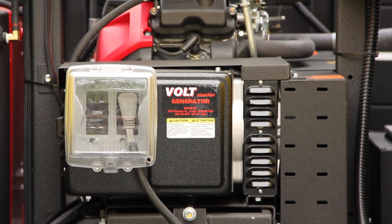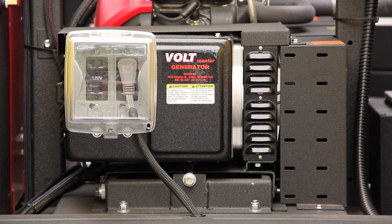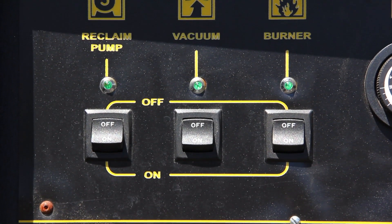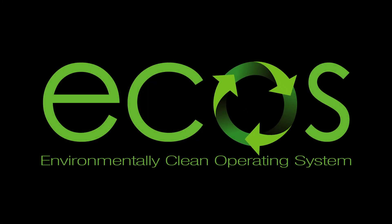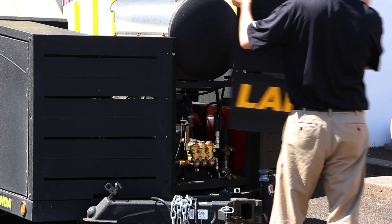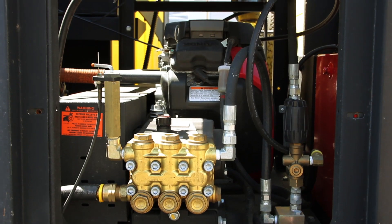The really nice thing about the new Hondas is they come with a low oil shutoff. We actually relocate that shutoff light to the panel, so if you're running the machine and it stops, you open the panel and see that light — you'll know it's a low oil light. In the front of the unit, one panel needs to be removed and you have instant access to everything that needs to be serviced.